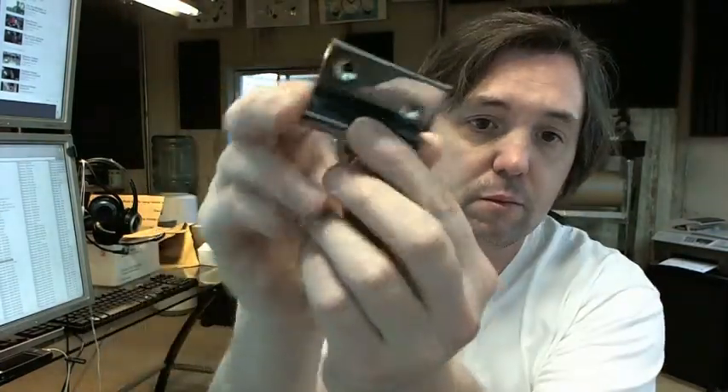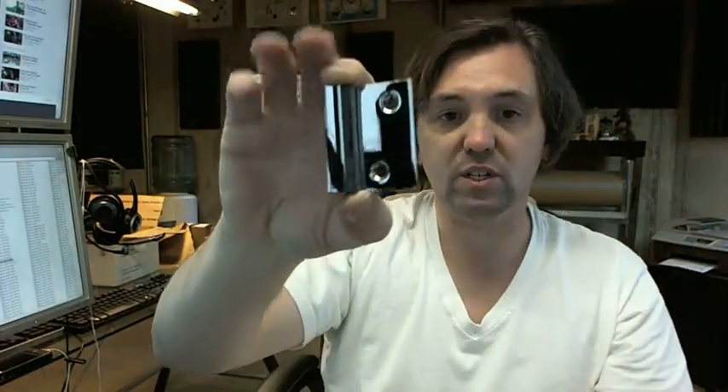That black area you see is a rubberized stop — that is the face of the rubber stopper. 625 denotes polished chrome, just shiny car bumper chrome is what this is. This could be surface mounted, though it would generally be mortised, which is how you would ideally want to see this installed, especially if your application allows it — although surface mounted is possible as well.